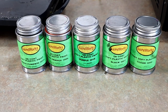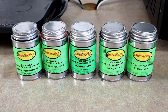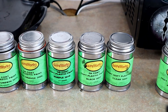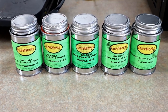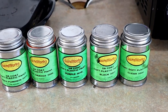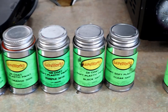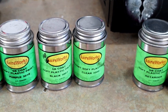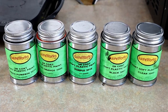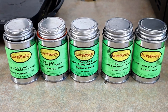Let's talk about painting soft plastics. You're going to want a paint that's actually made for soft plastics — you have this SB Coat here, the solvent-based stuff from Lure Works. This is readily made for airbrushing soft plastics. It does not need to be sealed or clear dipped or anything like that, although we are going to run a clear coat over it just to make the colors pop. You can pretty much just spray this stuff right on a bait and it dries within seconds.